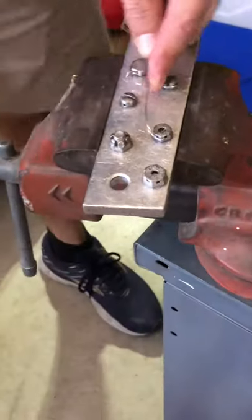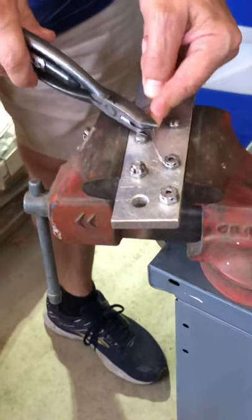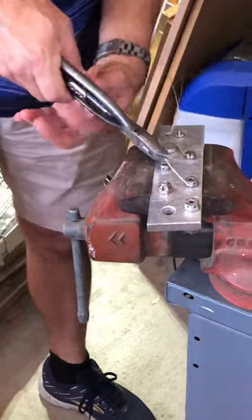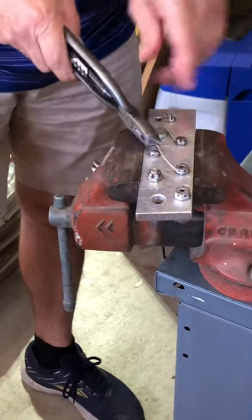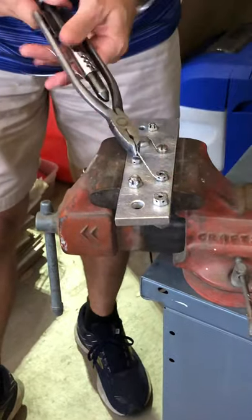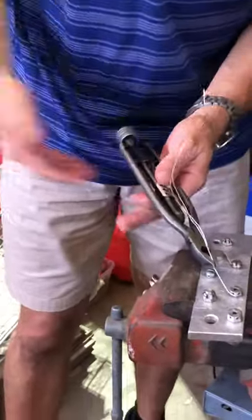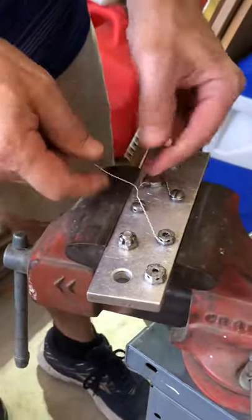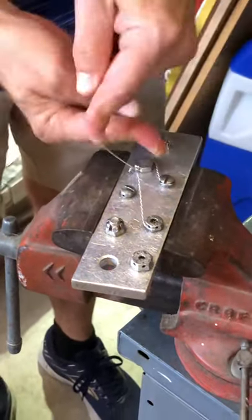Here's the wonderful thing about safety wire pliers. It does put tool marks in the wire, which is one of the reasons I never do this inside of an engine. You gotta be careful because these little wires are gonna whip around — I just pull it. So I get my six to eight twists per inch and I'm done. Then I always finish it off by hand so that I don't go too far. It looks good right there.